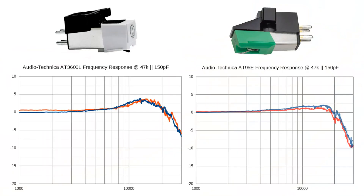First, the frequency response measurement, going from 1 kHz up to 30 kHz. The first thing we notice is a quite prominent bump, centered around probably 13–14 kHz, reaching something like 3.5–4 dB. We can also see there's a little bit more difference between the two channels already at 1 kHz. As part of my cartridge setup and alignment procedure I try to get both channels to perform equally well, but on this cartridge there's a bit more difference between channels than on cartridges I've tested previously — maybe the tolerances are not quite as tight.